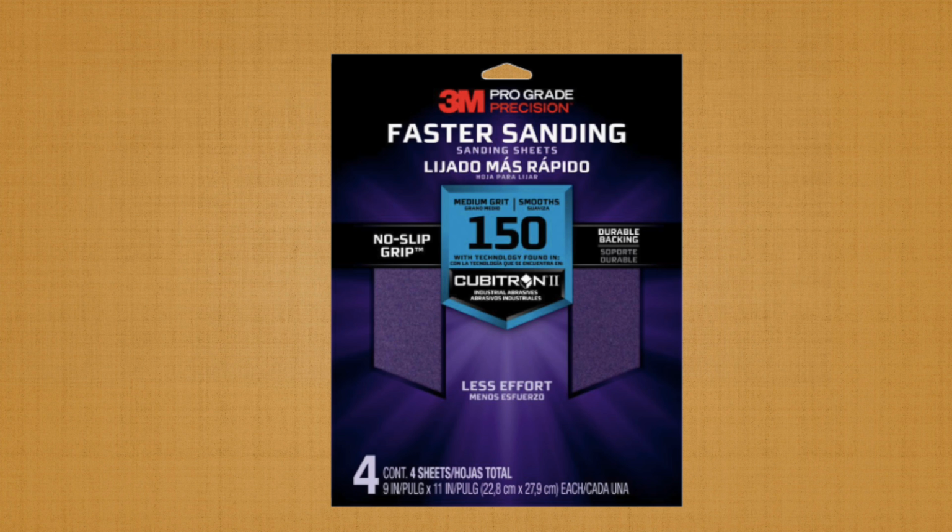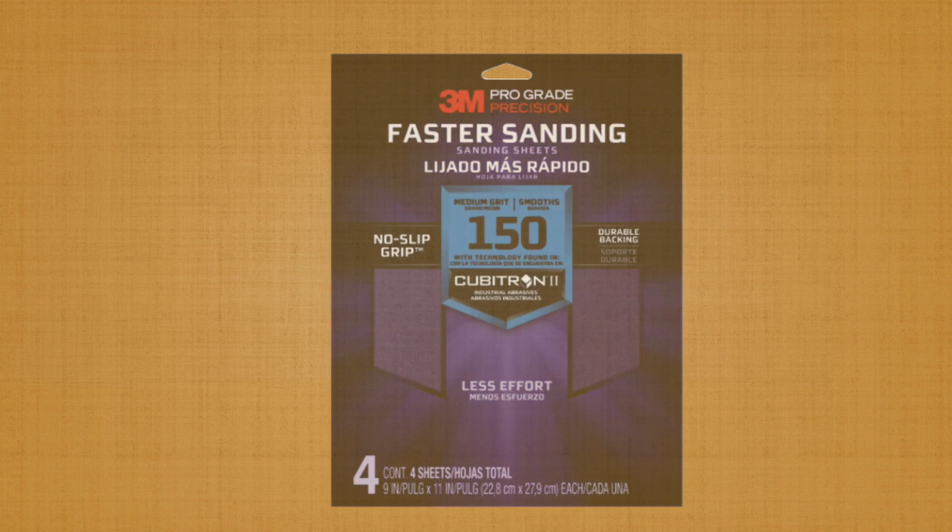You're going to need it in at least 150 grit, 220 grit. Those are the two grits I used, but if you possibly need to get a coarser sanding going, then you want to go down to like an 80 or a 60. But my word of advice is you always want to end with 220 because it'll make that wood baby smooth.